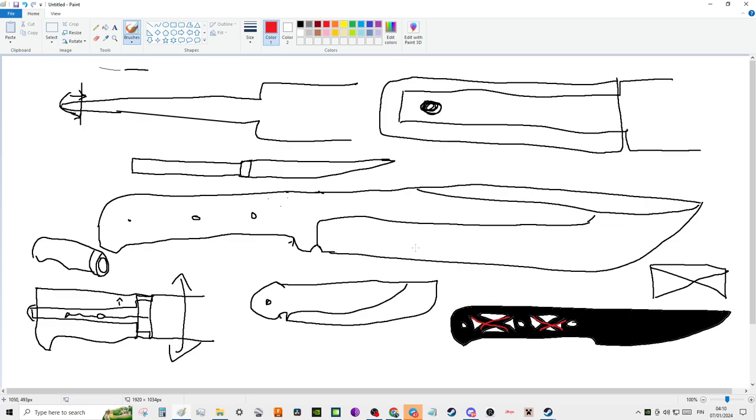It really comes down to how you think things through and how you visualize the forces going through a blade, right? So, for example, in this chopper here, you impact here. What's happening? Where are those forces distributed in the metallurgy and the profile of the blade? Where is it going to bend from? Where is the smallest point of the blade? Where is the thinnest part of the blade? Those are the things you want to think about if you're going to create something that's super thick, super strong and abuse resistant, especially if you want to baton the crap out of it.